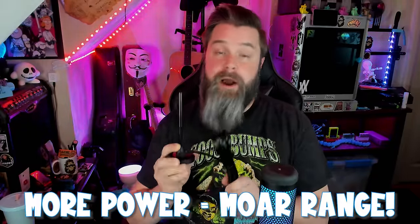Then we have the large curly boy. This bouncy guy goes from anywhere from 700 to 2,700 megahertz, and it's good for things like mobile communications like LTE — long-term evolution. Next is this big heavy guy, which has the same frequency range as the large springy boy but with a lot more power — a much more powerful antenna. And that brings us to our last antenna, the silver telescoping guy. This one goes from 40 megahertz to 6 gigahertz. It's the jack-of-all-trades of antennas, and you should actually be changing the length based on the frequency you're trying to use. If you use an antenna made specifically for the band you want, it'll work better, but this works for pretty much anything.